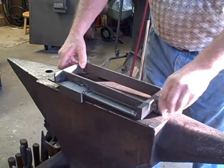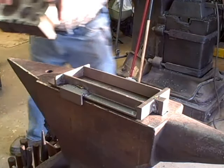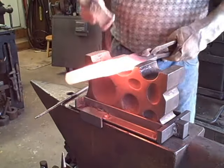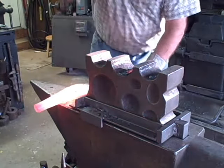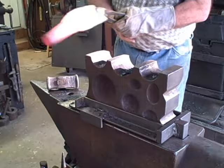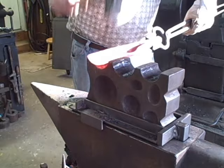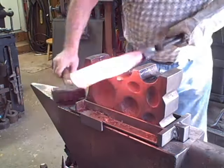This is my solution to the swage block bouncing around. I made a saddle which goes into the hardy hole and then skirts the anvil on the other end — this ended up working very well. You can see it takes many heats; you're only seeing probably less than half of them to keep this video short. I also speed up these clips. Work just a little bit at a time, closing that into a barrel using the mandrel inside to keep it from collapsing.